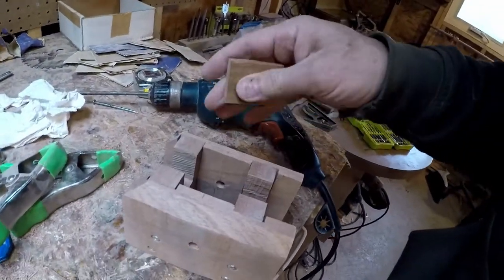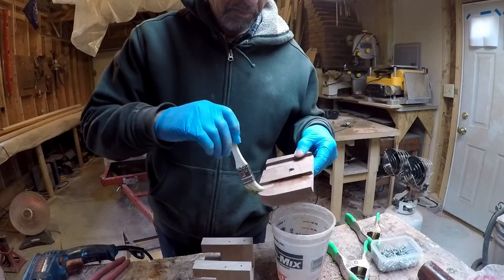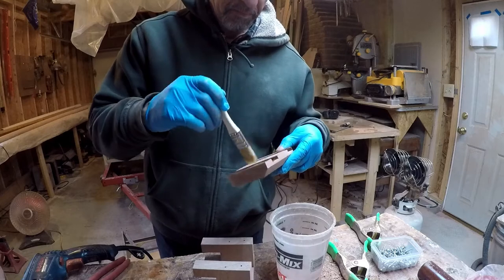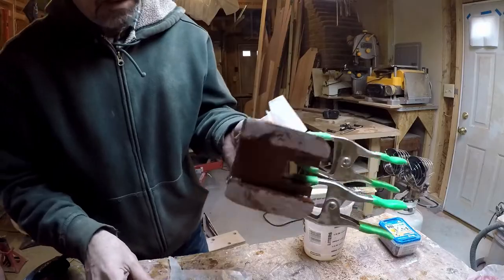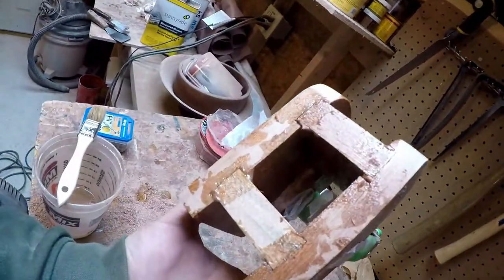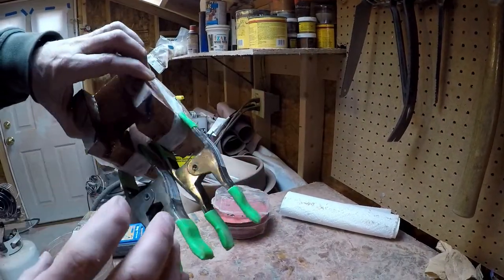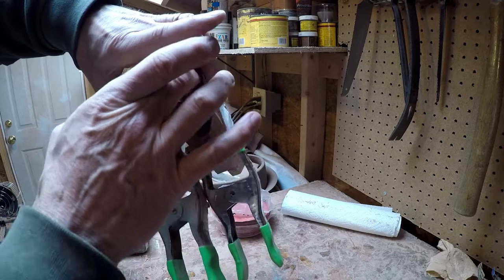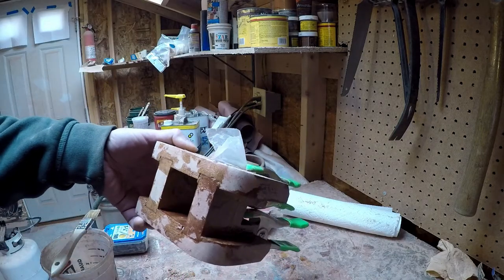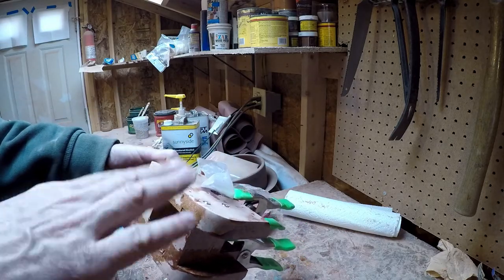To get max strength, I'm going to glue these guys in. It's certainly not pretty, but puttied in the gaps and filled in those pieces so that will be a solid joint with the mast step brace, contact with the keelson, contact up here to R1. Even though that's going to be under tremendous force, especially forwards on the mast, pushing back here and side to side, I think that's going to be okay.